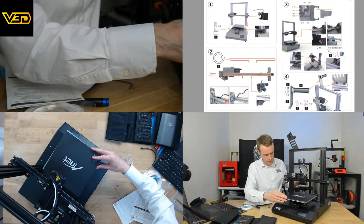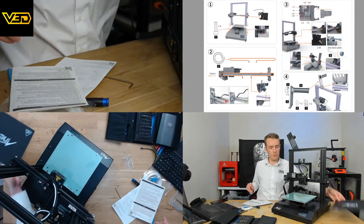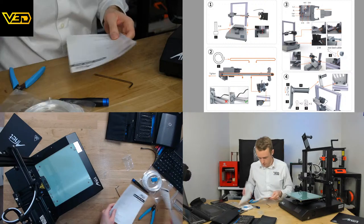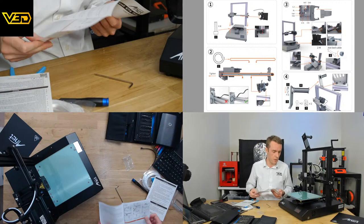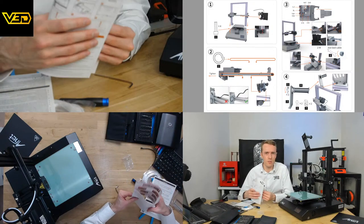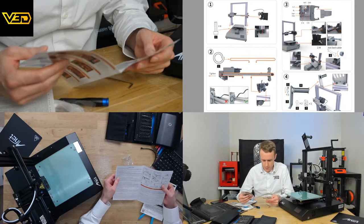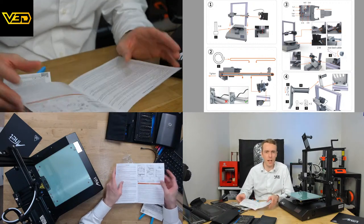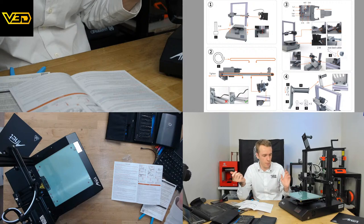It's pretty much the right size, but I don't think we had the same thing with the other ET4, to be honest. Some glass that was there, but didn't really stick to anything. I did used to actually print on glass quite a lot, but it's hard work to get right. It's not trivial. It's not as easy as some of your more modern or more widely used surfaces. I mean, BuildTak sticks to PLA like nobody's business. But then getting it off of something with glass, again, not great. If you have it like not aluminium, spring steel plate, being able to flex off is absolutely fantastic.